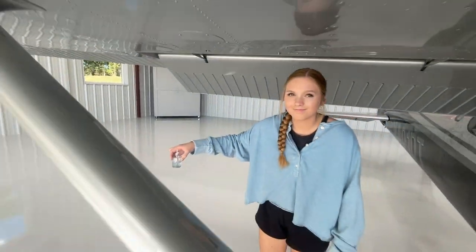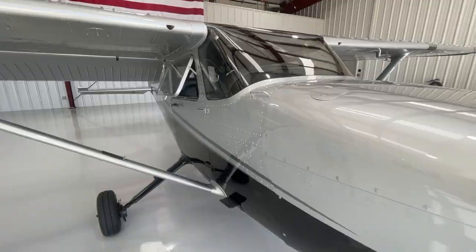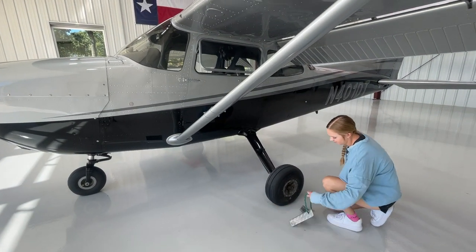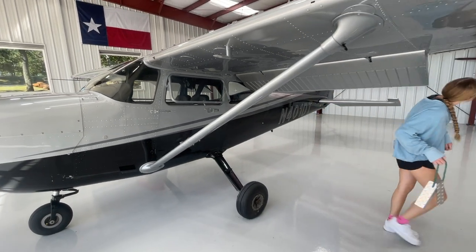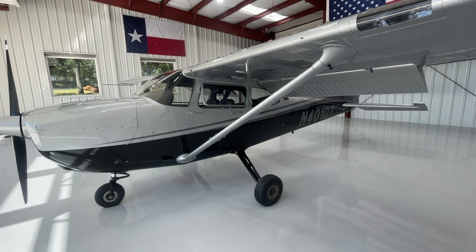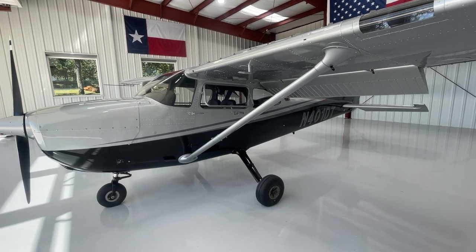The last thing to do is remove the wheel chocks. If the airplane is parked outside on the ramp and the ramp is uneven, consider putting the parking brake on before removing the wheel chocks. Hope this video was helpful — if so, hit the like button, subscribe if you haven't already, and visit our website at freedomflat.com.